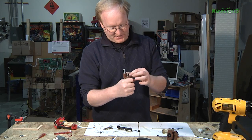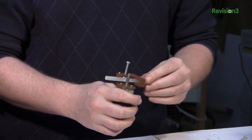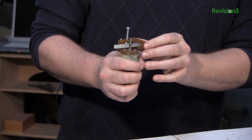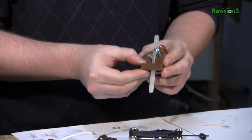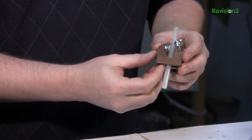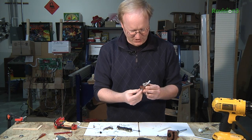This isn't really the right way to do it, but it's just a proof of concept. This will grip — there's a stick. You load it like this; you really only have to load it once because you just continually put glue sticks through. This is a lever, and by putting the bearing here close to the fulcrum point of the lever, this part applies a lot of force to it. This will clip onto something — we're not going to build that until we know this is solid.